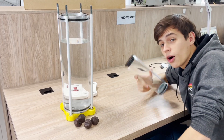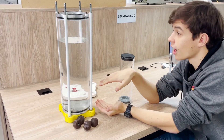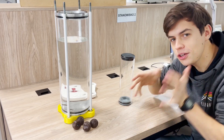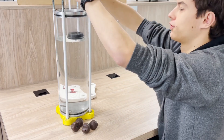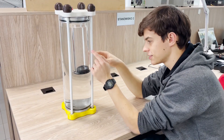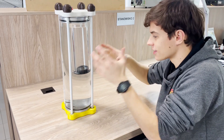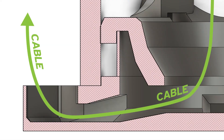Developing this solution took so much time that we designed our own pressure chamber that can simulate up to 85 meters underwater. We take the thing we want to test, put it inside the chamber, close it up, raise the pressure, and hope it doesn't leak. The upside is we can test everything in our workshop without needing to rent a boat and go to the sea. And yes, water leaking through the inside of the cable was rather shocking and unexpected to discover.